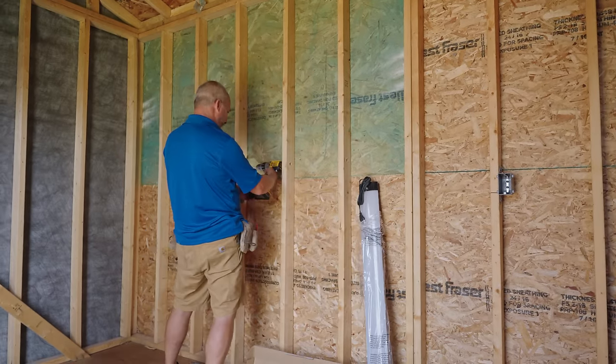a regular light switch. If you bring your power to the box, then your light switch power, black goes on the bottom. Your white gets wire-nutted to the other white to bring the neutral up to the light fixture, and then the black from the light fixture goes to the top of the box. But in this case, our black and our white are functioning a little different. Okay.